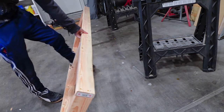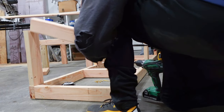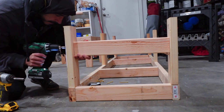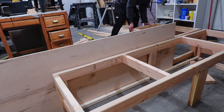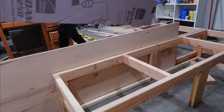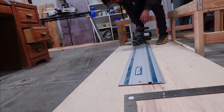The shape of the bench is like an L, so attaching the legs was pretty straightforward. To help stabilize things, I added more cross members for the legs, again using butt joints. After checking it for square, the frame was done. Now it was time to put the skin on the bench — half-inch maple plywood. Here I'm lining a larger sheet up against the bench, scribing out the height, and cutting it out with my track saw.